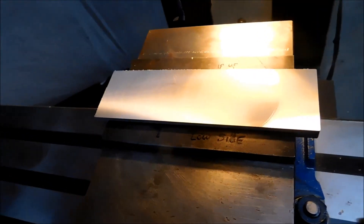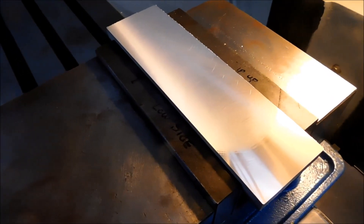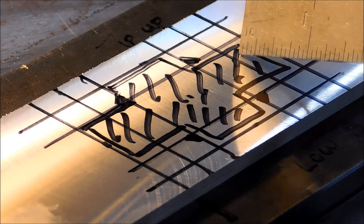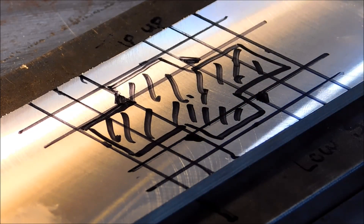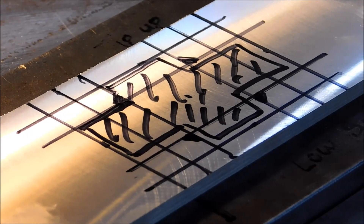Let's draw a little bit of artwork on this piece, cut it out with a 3/8 two-flute carbide end mill, and make it look like the piece on the board. This is today's chore: we're going to cut this out like a regular standard cross with sharp corners on all eight tips and large 45 degree chamfers on the inner four corners, using a 3/8 two-flute carbide end mill. Hopefully we can get it done relatively quick. I will accelerate this as not to bore you, and when I put the broach in we'll slow it down and talk about it.